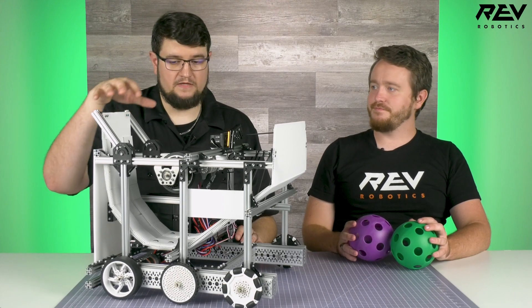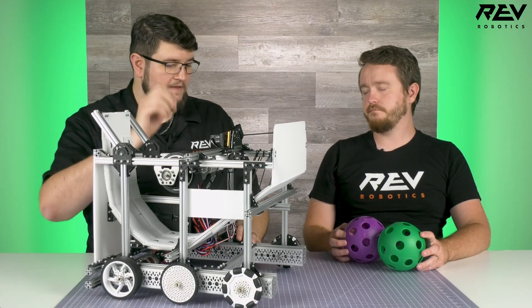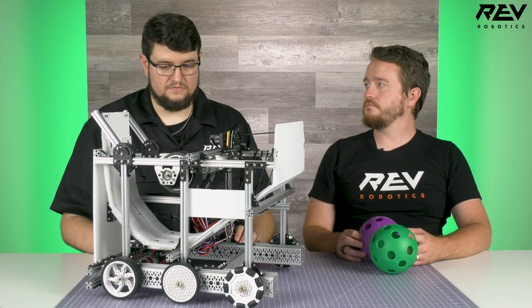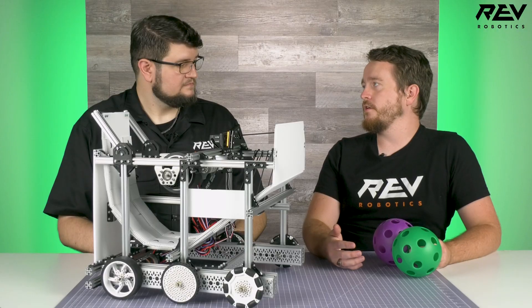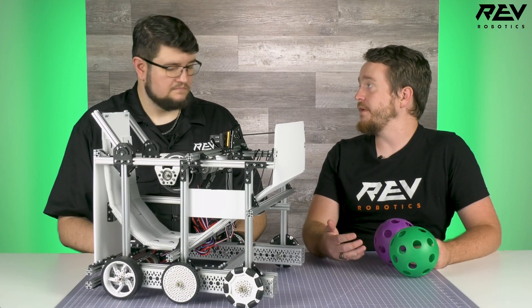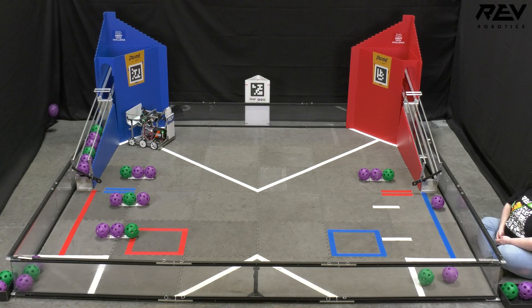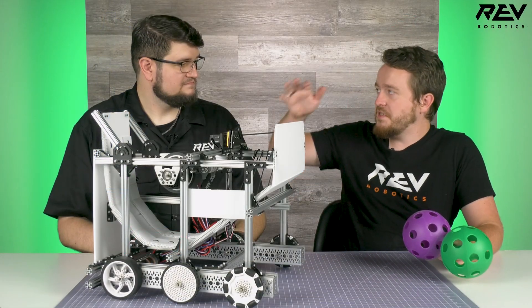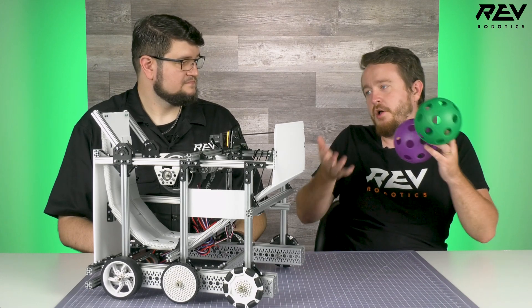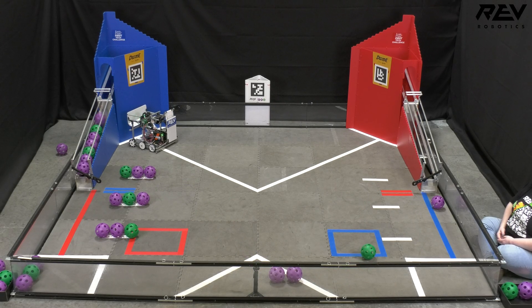In terms of consistency with a launched piece, the biggest piece of advice is to ensure that your design has adjustability built in — whether automated or manual. Chances are you're going to need to adjust the angle. As you design, make sure that your arc is consistent without low spots and high spots. Once you have that adjustability, you don't have to worry too much in the design phase about having the perfect shot — you just need to worry about having the same shot every time, because you can get the perfect shot once you build it.